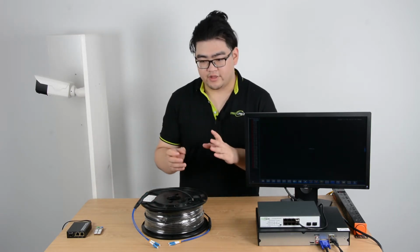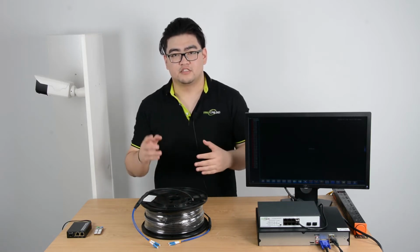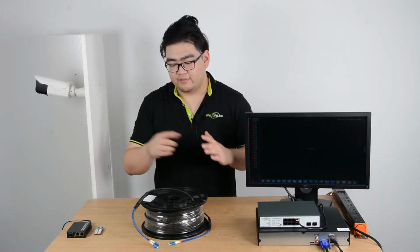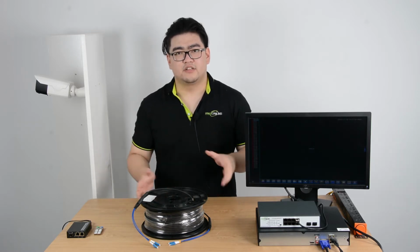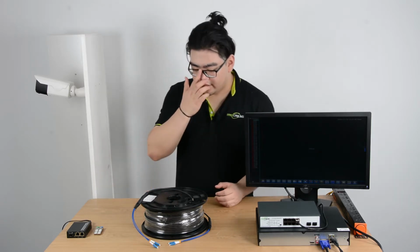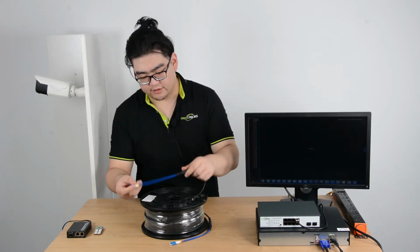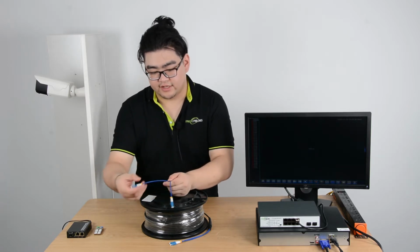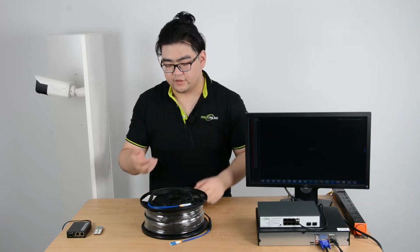Also, the inside of it has plastic wrapping around it, and the signals bounce off the plastic inside. It's like a mirror, it bounces off. And then it bounces and travels, so there's barely any signal loss in short ranges. This short range is like within 1,000 meters. So let's take a close look at this cable. Fiber optic cables seem thin, but they also have a protective layer around the plastic wrapping that the light bounces off.